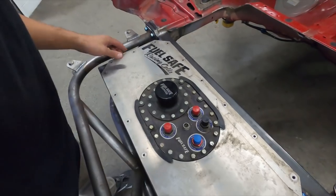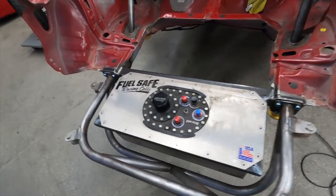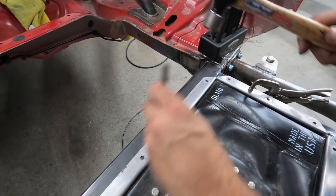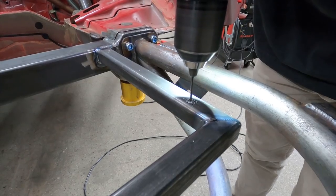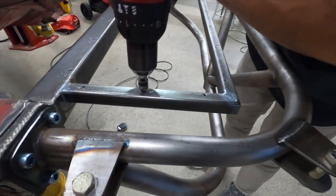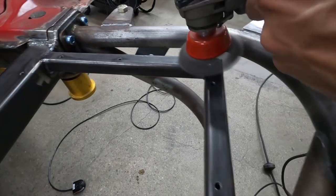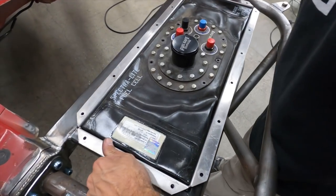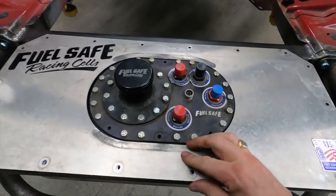Perfect fit — look at that. Damn, looking minty. Dom's drilling some pilot holes. The metal Dom used is thick enough for us to just tap. He found some M6 hardware — I have some quarter-20 stuff but it's all good. We'll drill it, tap it, a little easier, and we've got plenty of M6 hardware. We'll tap them out and get this thing bolted right in.